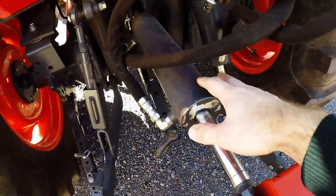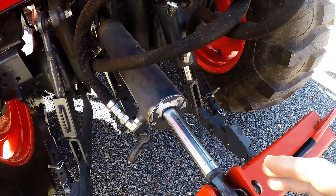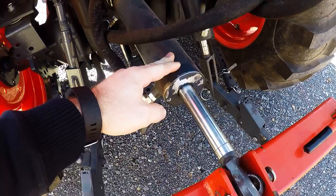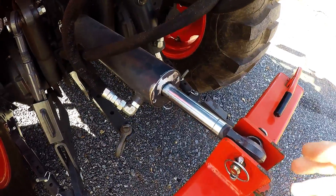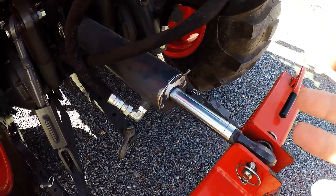It's also important to get one that is large enough in diameter. I've seen some places just selling hydraulic top links in different lengths but not in larger diameters. For example, you wouldn't want to use a small hydraulic top link on a tractor that's 100 horsepower. Because if you go with one that is too small in diameter, when you get to pulling hard with it, the hydraulic top link could extend all the way out or retract depending on if you're pulling or pushing.